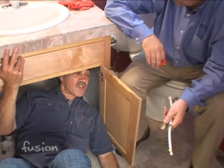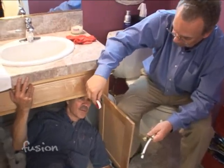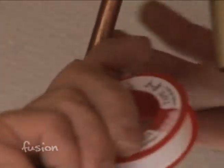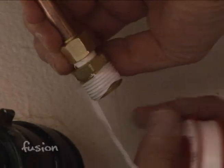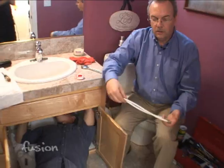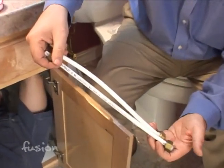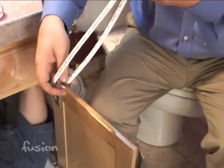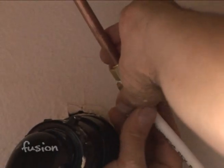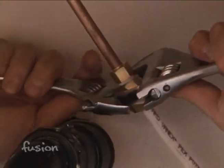The pop-up is working, so next we reconnect the water. Make sure those new fittings at the end of the water supply are wrapped with Teflon tape so they don't leak. When applying Teflon tape, go righty-tighty, start at the bottom, keep it fairly taut, wrap a couple of turns around the fitting, then give it a pull and it will snap. We're going to reuse the water supply lines — this is a fairly new house with PEX tubing, which is a code plumbing supply tube we can reuse. Screw those onto the ends you've already taped. The faucet is labeled on the hot side with a little tag that says hot, so that makes it easy.